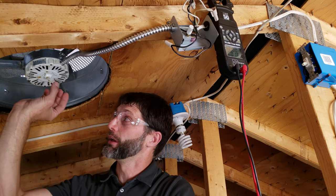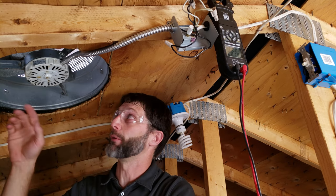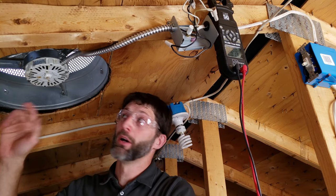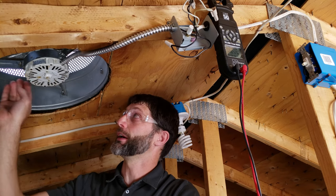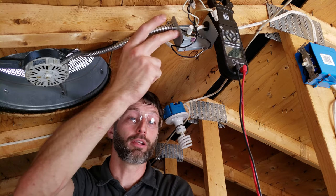There's no way to oil these sealed bearings, so we know this attic fan needs to be replaced. We don't want to try to put oil in there or spin it until it frees up — we just need to replace it. But say it did spin fine; we'd go back over here to continue the diagnosis.